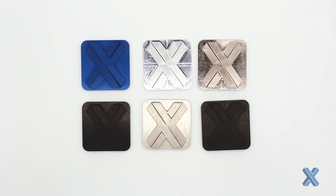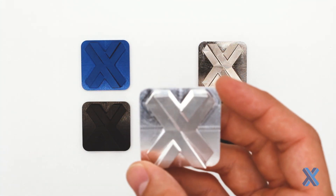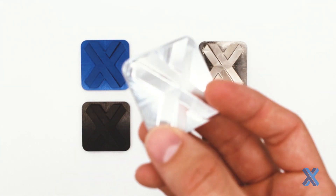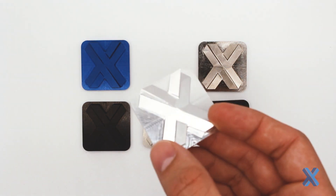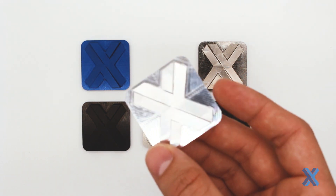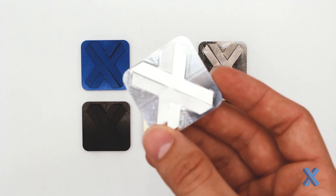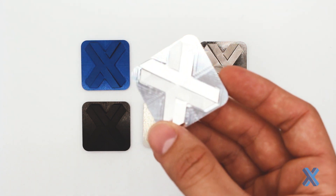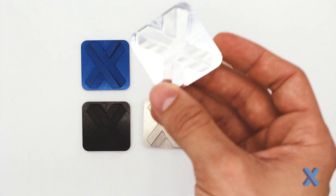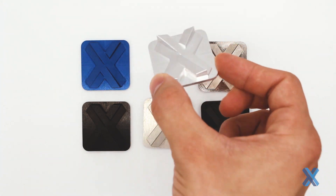I'm really looking at this because I'm trying to protect my part over time. I have an as-machined aluminum part here. This part may be prone to corrosion or may just not be as tough as I want it to be over time, but I like aluminum because it's a commodity material — easily available and cheap. So let's mill our parts with this, run into production with this. It's a great material, so let's give it some enhanced properties by using different finishes.